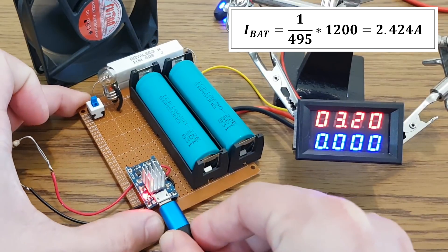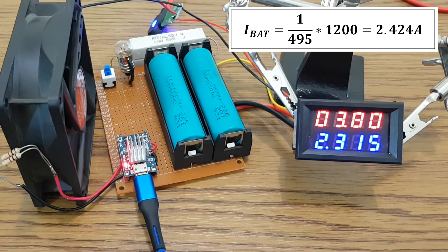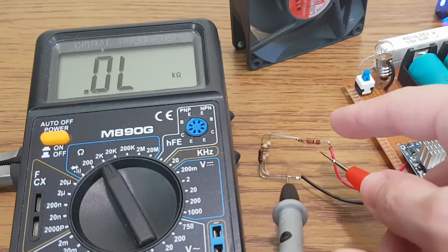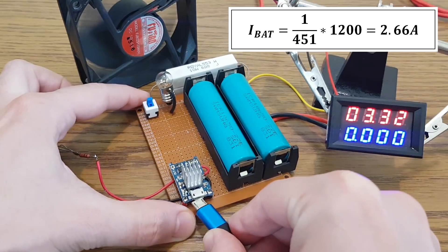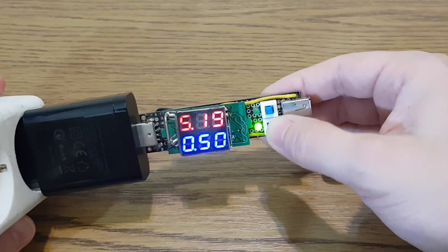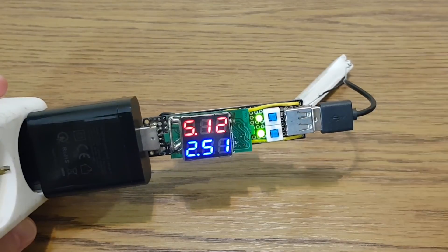This module is very tough, but we finally reached the limit of the integrated circuit. No matter how hard I try to increase the charging current, above 2A it's not stable anymore. And it's not the USB charger's fault — you can see that it can deliver 3A with no problems.